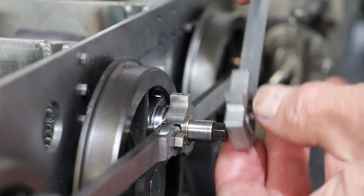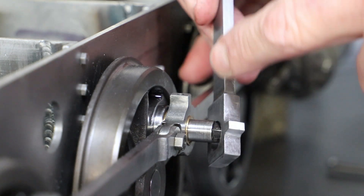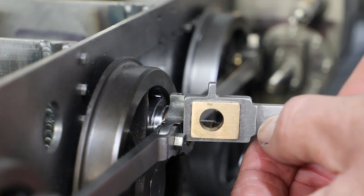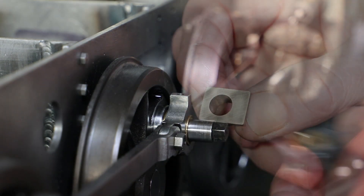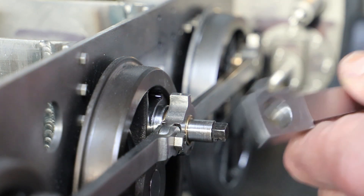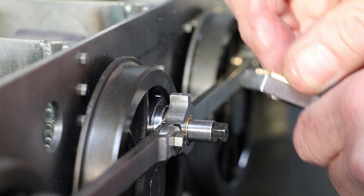This time I made the big ends asymmetric, with the inside surfaces protruding an extra millimeter in towards the coupling rods, which you should be able to see in this view here. I also adopted a bit of a cheat for the big end bushes — rather than machining a rectangular bush, I turned one which has an outer face that is rectangular to make it look like the part Don intended, but a lot easier to make and a lot easier to install into the connecting rod.